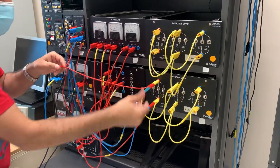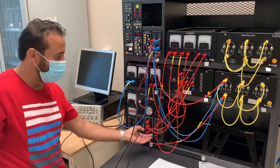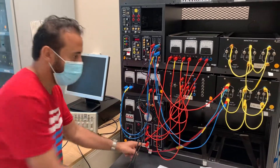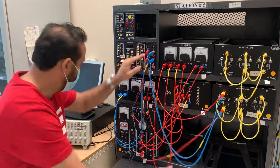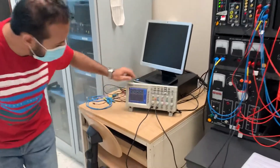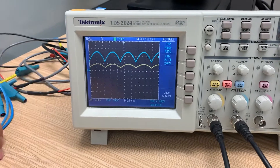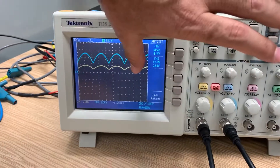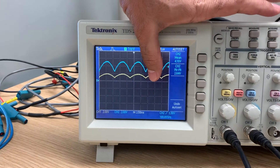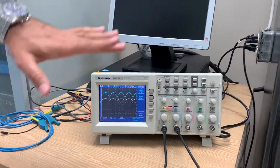That's the resistive load by itself. We close the circuit back to neutral — since this is three-phase, we use three phases and close to neutral. This is my voltmeter and voltage isolator. Turning on at 90%, I can see the output: the blue trace is voltage and the yellow is current. Counting 6.75 boxes, I find three pulses per cycle.